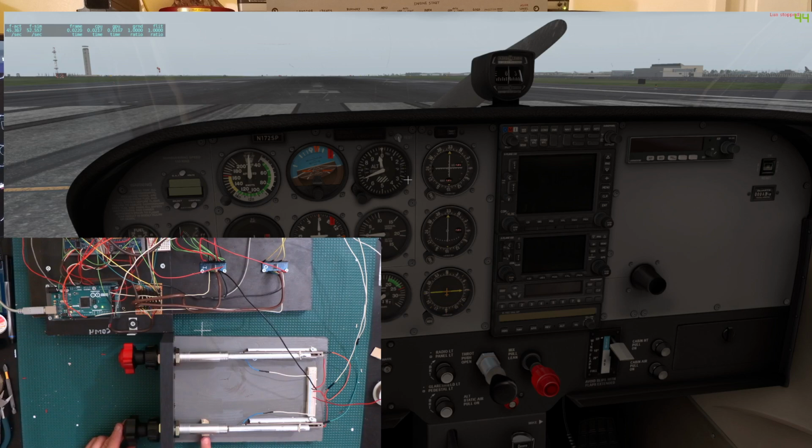I also ended up having to put a little block of wood underneath here, as you can see, just so that the level of the rod was the same as it was coming closer, so that the movement can be pretty smooth all the way through. And the only thing that I would need to do now, if I was completely done with it, is put some lithium grease all over the rod right here, or at least the part that goes inside, so that there could be less friction and it could move along freely. And that was it. This is the one that I use. I basically just bought it at, I think, AutoZone, and it's just lithium grease, and that's it.